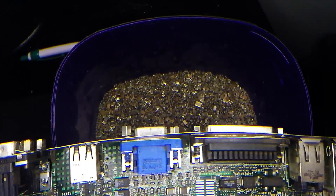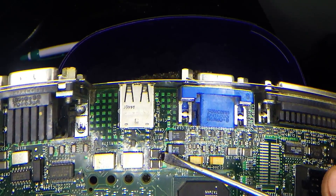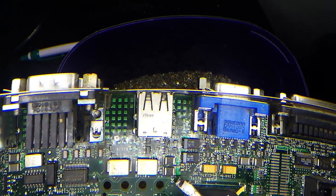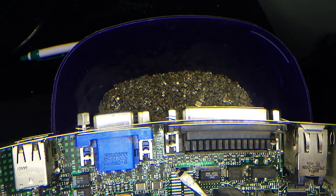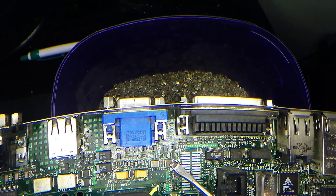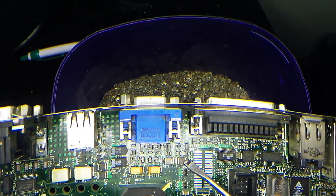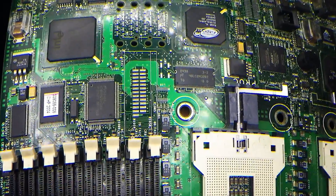Now scanning up the board, right here you can also see a couple of chips that look like MLCCs, but as you can see this is L30, L40 — these are labeled Ls. Over here, that's L35, L34. These are Ls, so that says they're inductors — therefore they're MLCIs, monolithic chip inductors. They don't have palladium, so if you pick these and mix them in with the MLCCs, that's where the problem is.